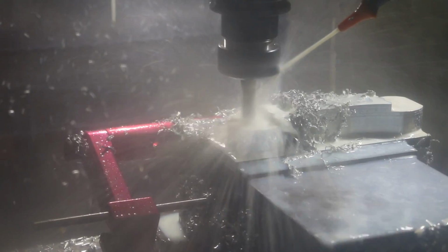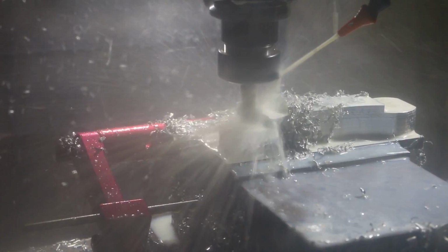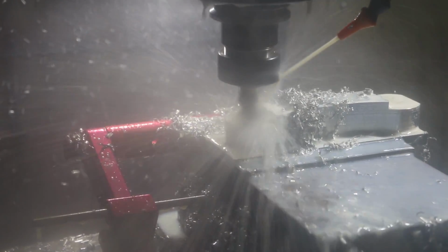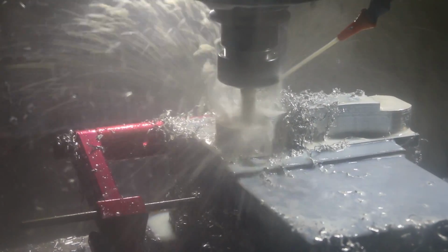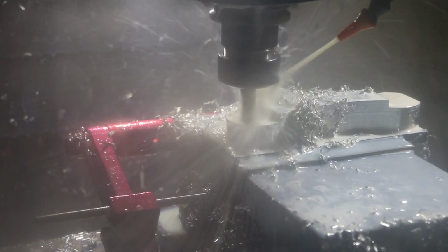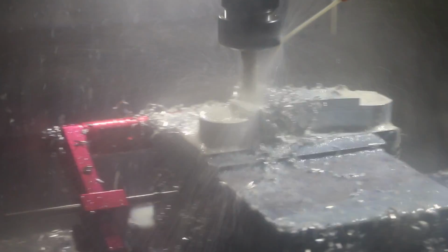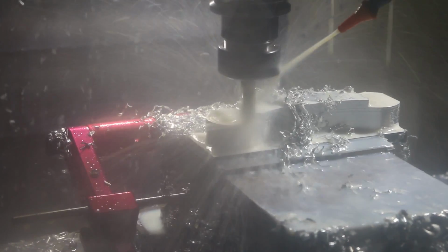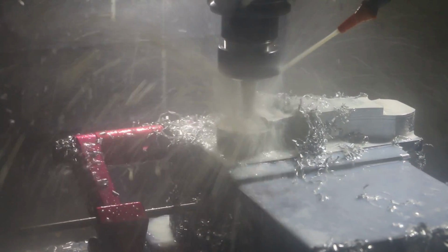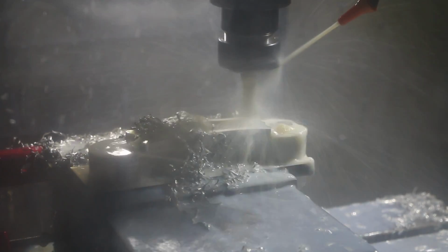That's reasonable. This is like the VF-1. They make much more complicated machines like this. Well, I would hope in 25 years they've made more complicated ones. More accurate too. You go up another whole order of magnitude or more in accuracy when you go to a modern machine. Here it moves in increments of 1/100,000th of an inch, and you can hold tolerances of about 2 to 3 ten-thousandths of an inch. And a well set up machine with really good tools, you can hold 1/10,000th of an inch or better.